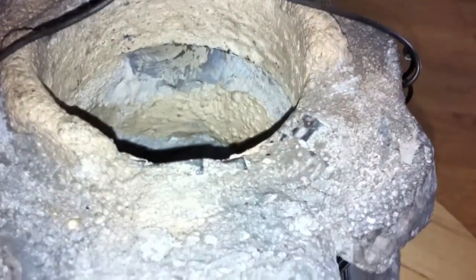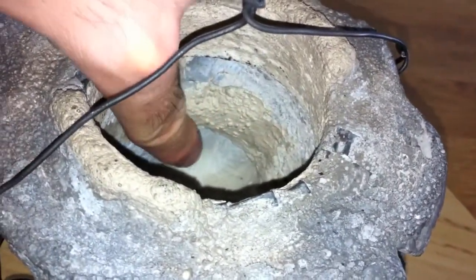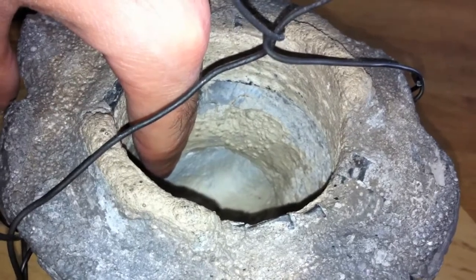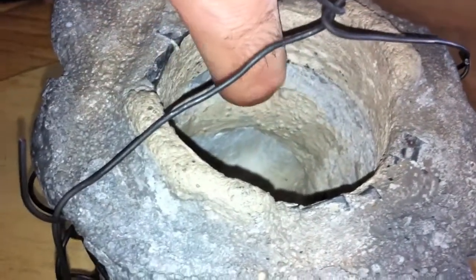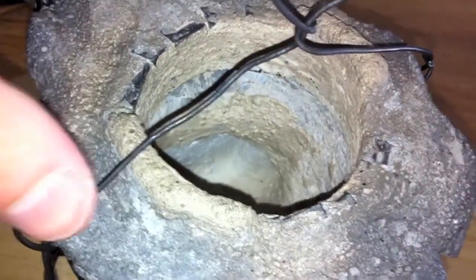And that was the purpose of shaping the inner refractory chamber. If we take a look at the outlet, that also has had additional cement applied right there, which seals off more of the fluidic interaction zone between the bottom inlet and the outlet, so that it makes it more of a forced path for the flame to follow.